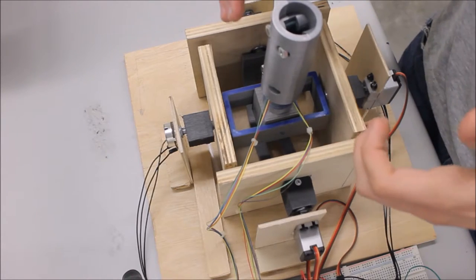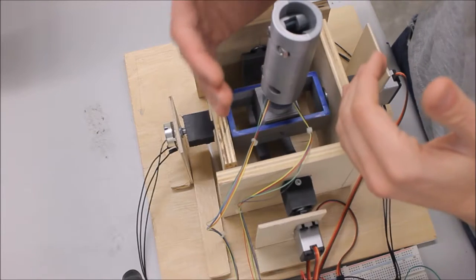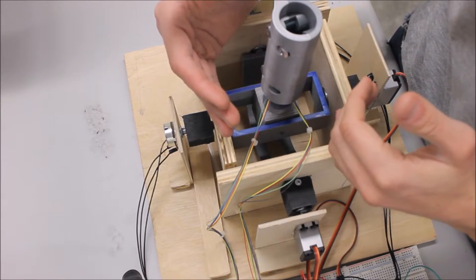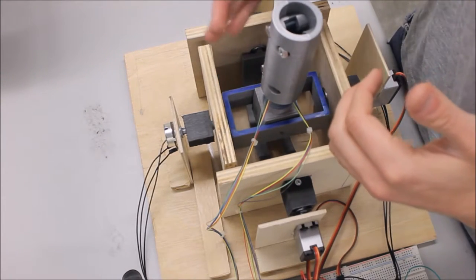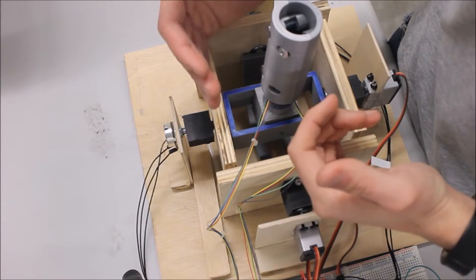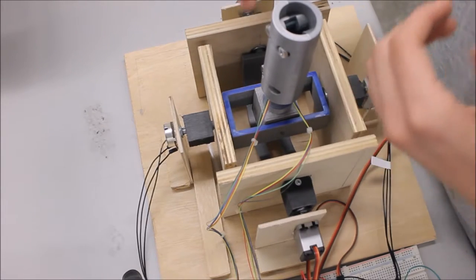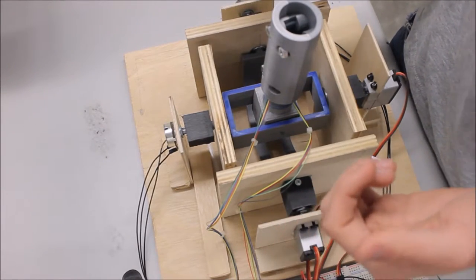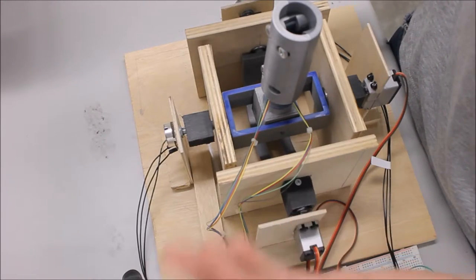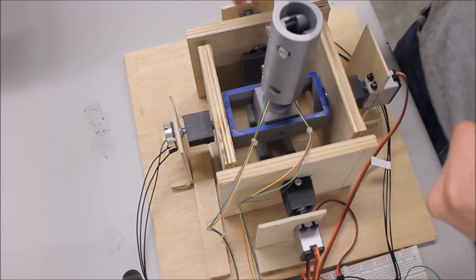So what I'll try to point out here is that the user isn't physically moving the gimbal mechanism. What is happening is the load cell is reading a force and commanding that position. So while it may look like and feel like you're moving the stick, you aren't actually moving the stick. This allows the fundamental idea of the active Sidestick, which is force feedback.